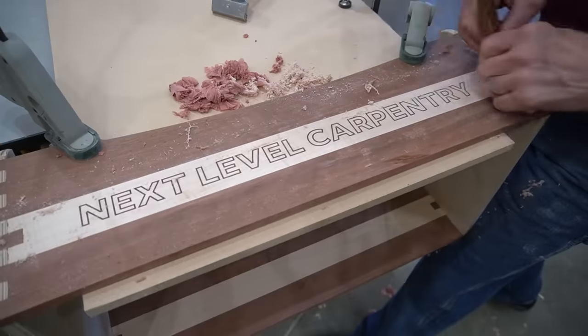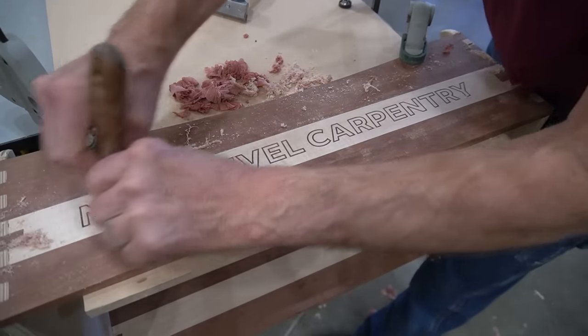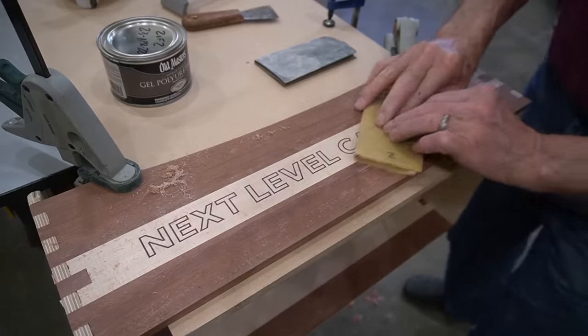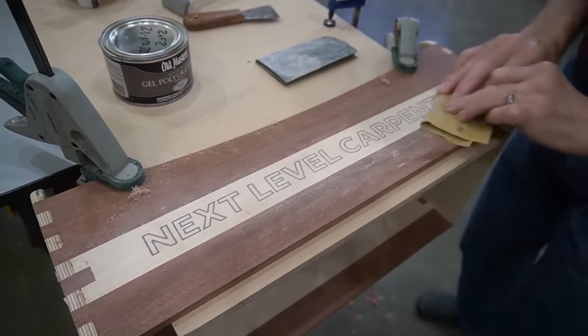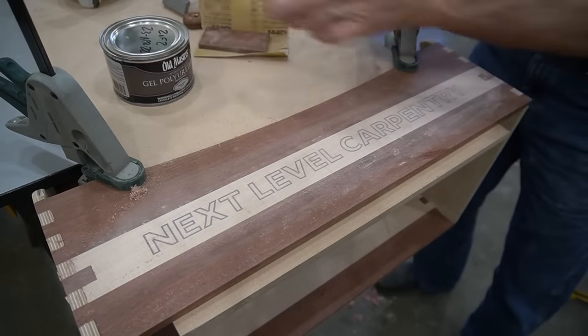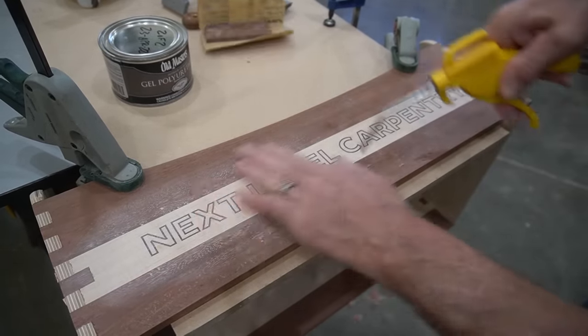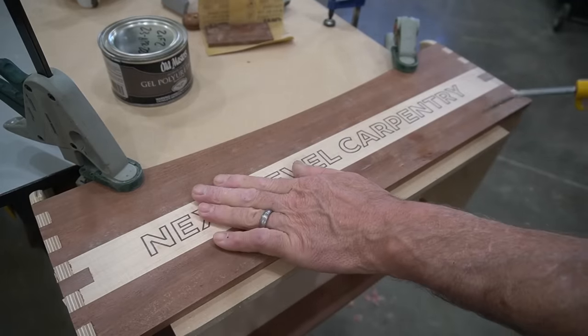And after removing the bulk of the epoxy and CA from the logo stripe, I switch to a sharpened putty knife and scrape at a diagonal across the entire banner to finish the cleanup and smooth the surface. After carefully scraping with the sharpened putty knife, I follow up by block sanding with 320 grit sandpaper and hand sanding with the 500 grit so that the surface of the lettering and the maple banner strip are super smooth,